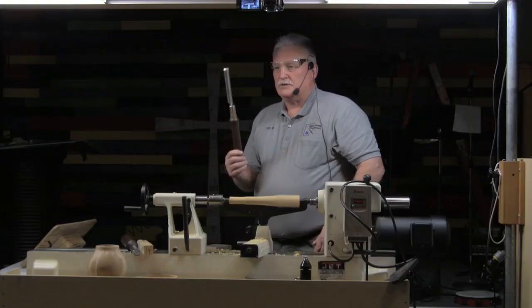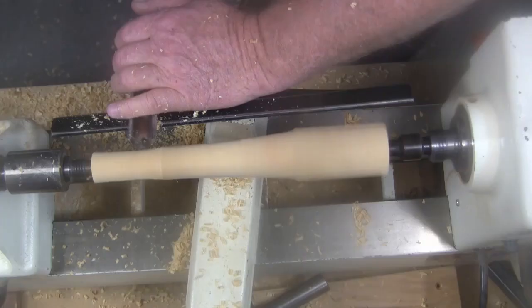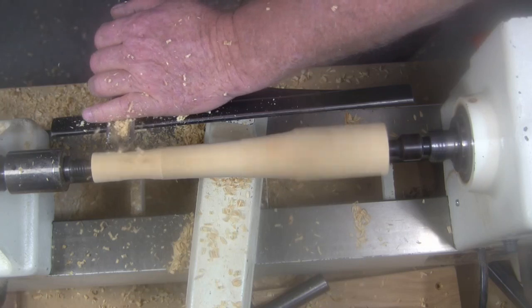The backside of that bevel — just about maybe a sixteenth of an inch of it — is rubbing on that wood, and that sets the depth of cut. To make it cut deeper, you have to raise the handle higher. If I push down on it you can see it burnishing the wood; if I raise it until it makes a cut, I have to move it along. If I just make the cut and stop, I just scallop it all the way down. The wood coming through the cutting edge is pushing that bevel down against the wood — that is all the emphasis it needs. It's feeding itself; it cannot cut any deeper if I don't raise the handle anymore.